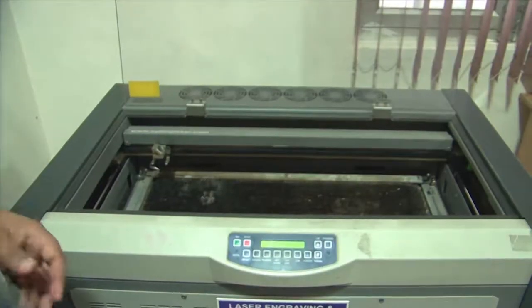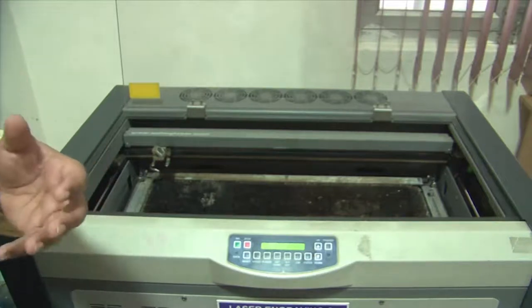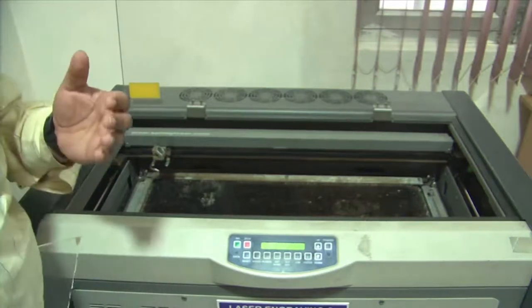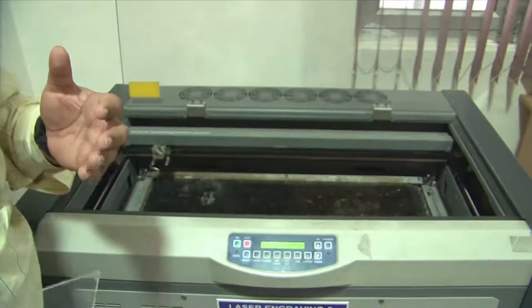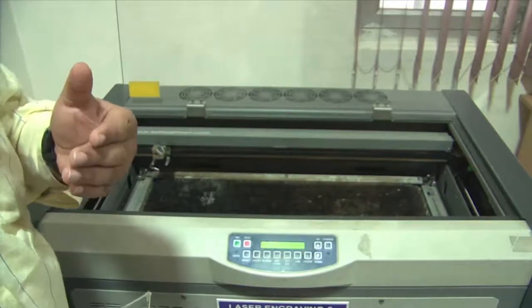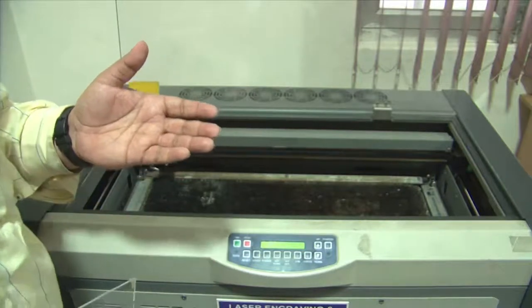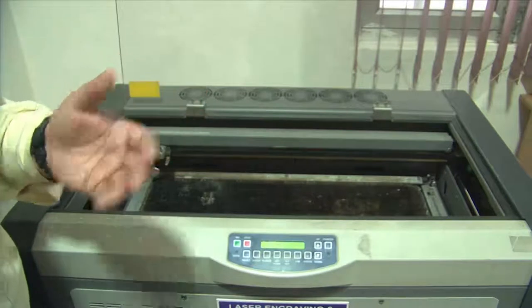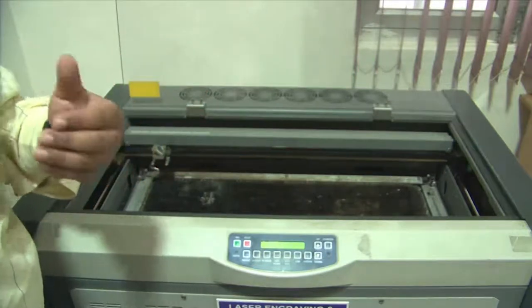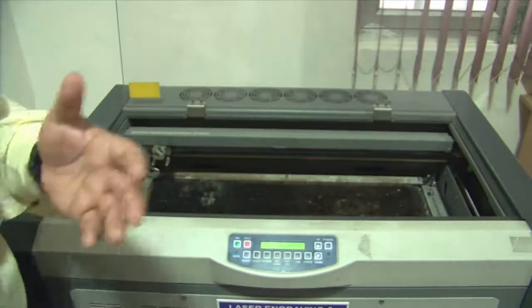But in this particular application, as we are intending to show you a way to fabricate a microfluidic channel or a microfluidic device, we really can limit ourselves to this resolution of about 50 microns. Our channel sizes in the current application that we are envisioning are not less than 100 microns. So we can easily use this lasing machine for such an application.